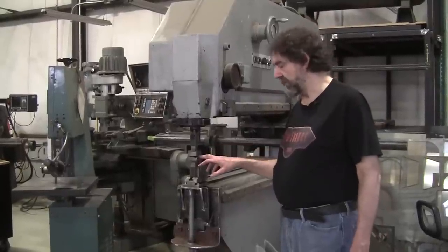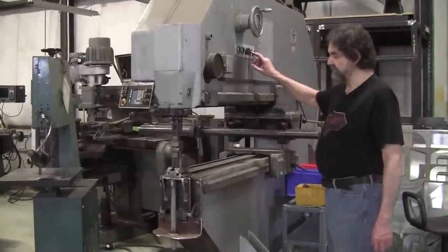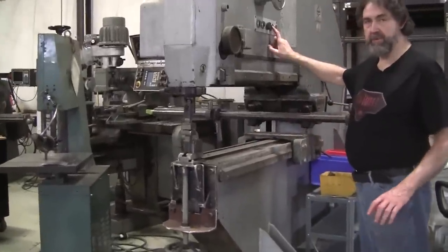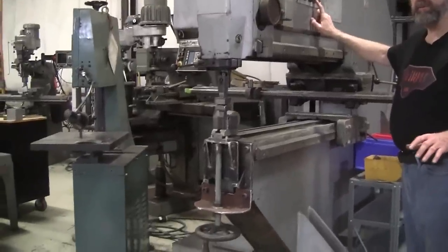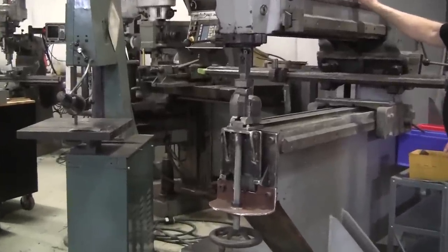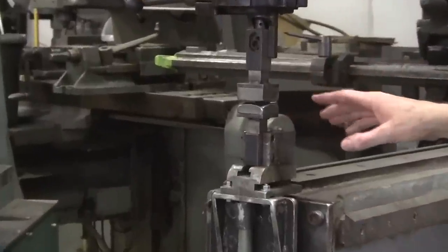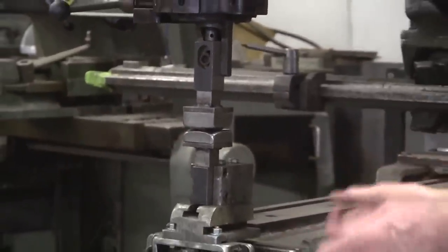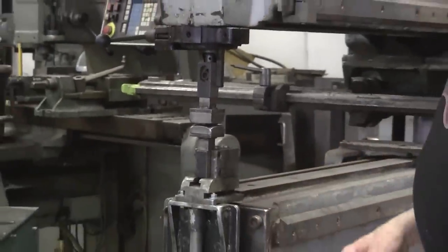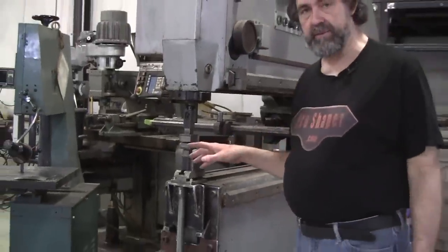And this has the 2-inch dies in it. Works pretty effective. And we'll just turn it on. I'm not going to show it tonight. This video tonight is just a quick overview of shrinking technique. So you can see that's the reciprocating action. And to get the shrinking going, you need to just pull the panel in and out real slow. On the way back, you pull out slow. And it's a pretty effective shrinker.